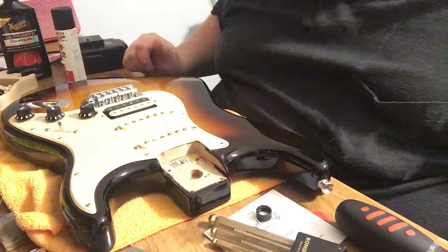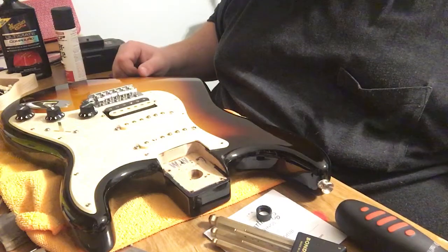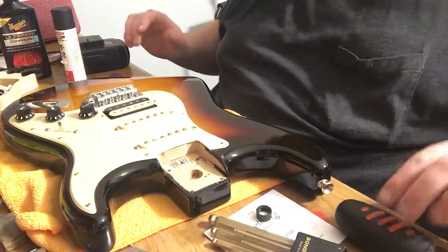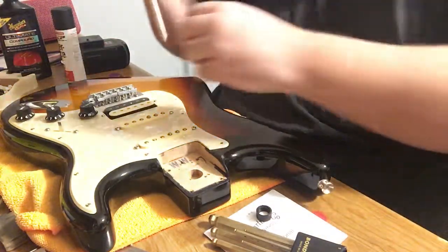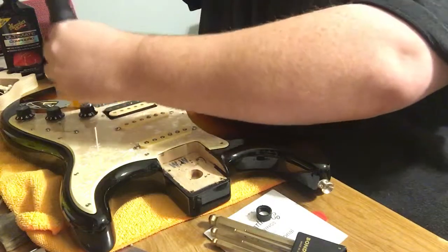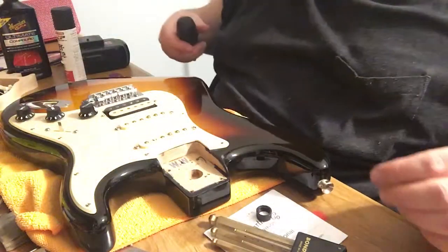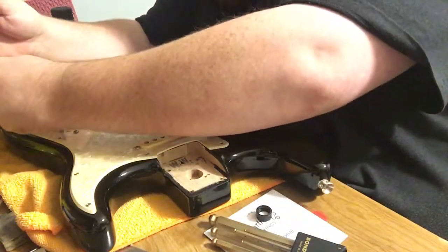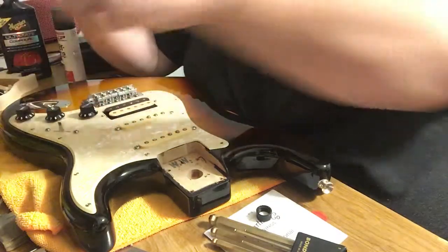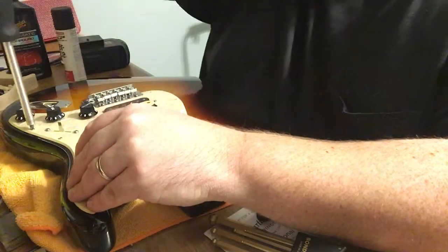I have a programmable soldering station that's off camera. I'll take a second video and show you how I've lined up this shot. It's great. It's a Radio Shack brand, but it's a programmable variable temp soldering station. I just turned it on to 300 degrees for right now, because it's going to be sitting idle for a few minutes, and I don't want to just let it sit there and cook. Basically, 300 is the lowest temperature the iron can be on.